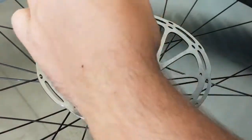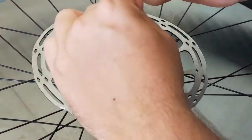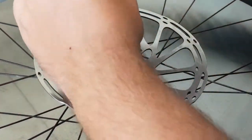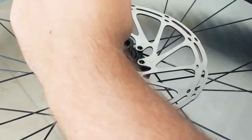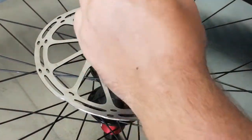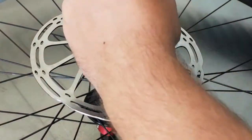Right now I'm just getting the bolts to the point where they're making contact with the rotor, and then I'm backing them off because I want to bring them all to tension via the torque wrench — basically just getting them all to a similar starting spot. I think it's a bit quicker to do this with the T-handle versus the ratcheting action of the torque wrench.